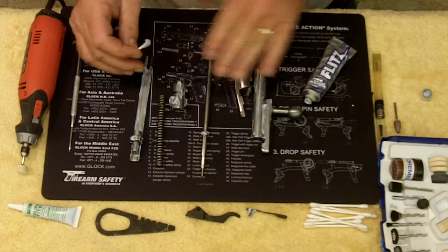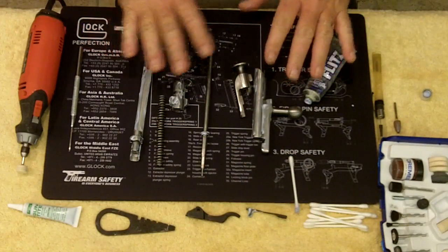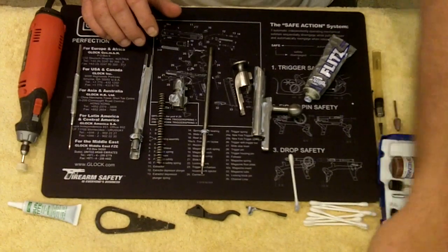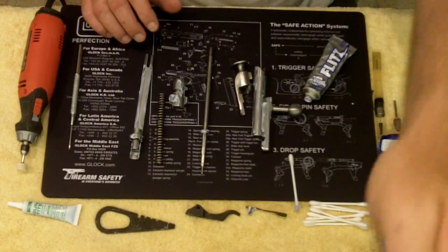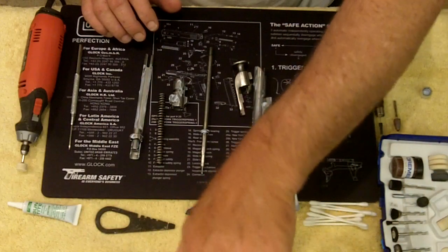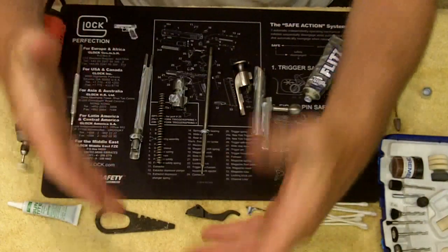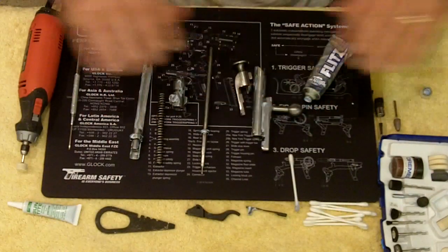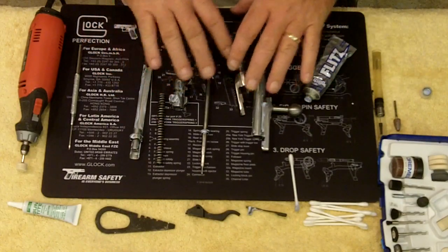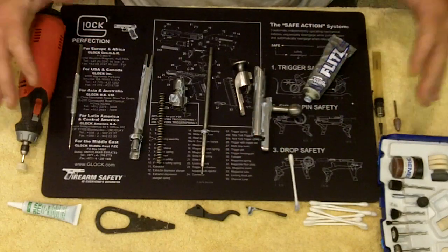What I'm going to do is let all this stuff just dry up a little bit, let the Flitz do its work. And when we come back, we'll start the buffing. By that time, I'm hoping the metal is up to temperature. I'll turn the oven off and just let that stuff sit in there and get back to it. Let it cool off in there. There's no reason to pull it out yet. Then we'll also pull all that out when it's ready. We'll wipe it all down. By that time, hopefully, I'll have the bolt completely buffed out, ready to go — the trigger, the sear. We'll put everything back together.